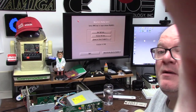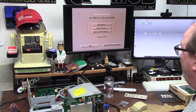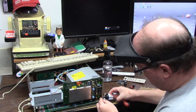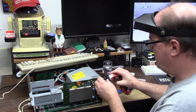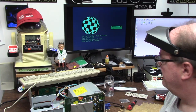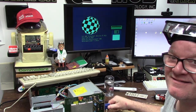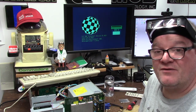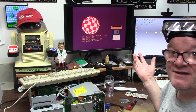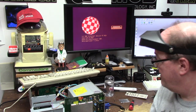This board is from 1990 from Commodore itself — right when the 3000 came out, they used its chipset to make a flicker fixer for the 2000. Putting screws in and she's going to live in here. Booting again — and this one's blue also. Oh — it's my monitor cable! So the whole blue thing was not the cards themselves, it was my VGA cable. Both cards work perfectly. I've got to replace this VGA cable — never underestimate your own cabling.